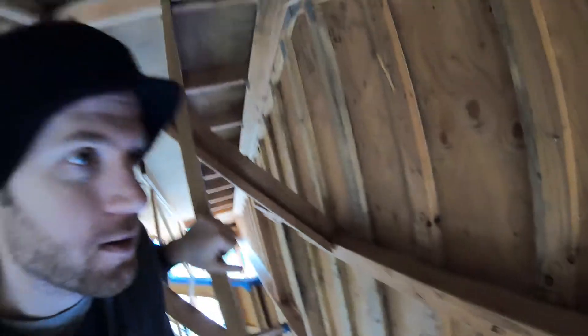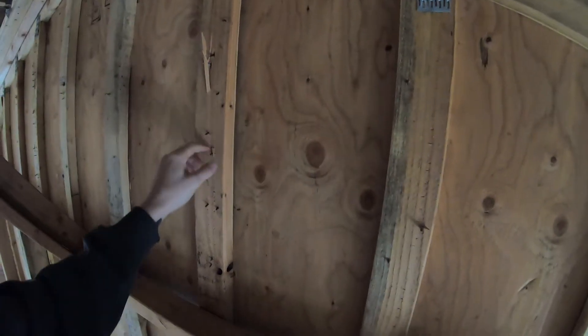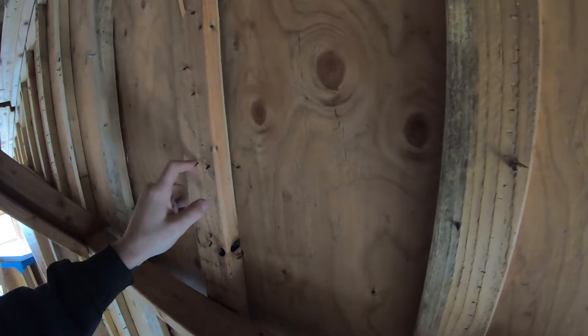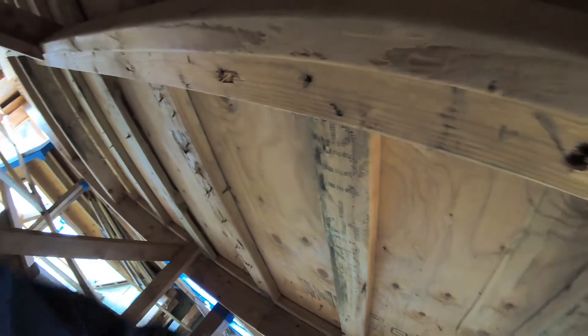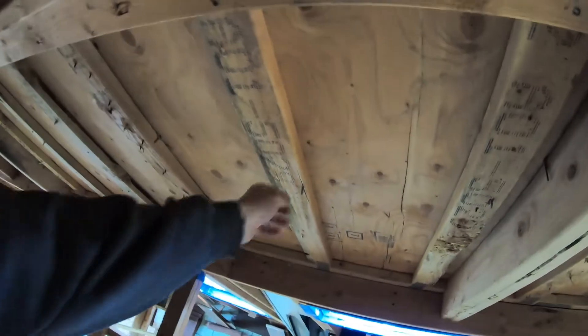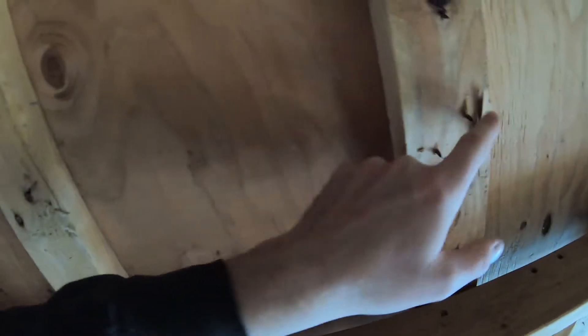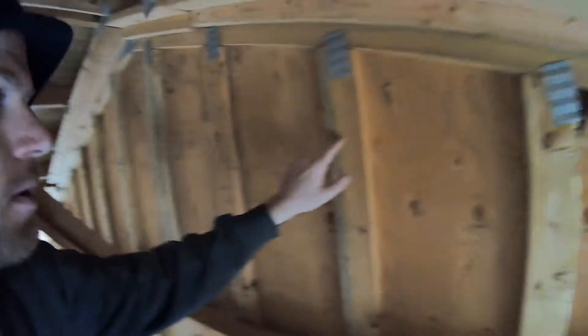The last thing worth mentioning — these guys. When they nailed the sheathing on, they used pretty long nails, probably two-and-a-halfs. It's probably better to use shorter — like two-inch would have probably been perfect. You can see these big ones coming through here. The ones I put in are holding the rain screen, and I also nailed it with three-and-a-half-inch ring-shank stainless steel nails — I don't see any poking through because they're not long enough, but they should be buried in these members.